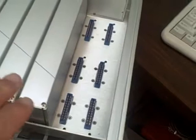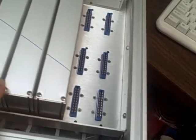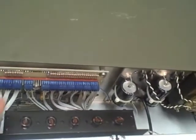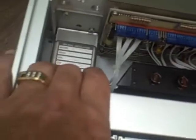I've opened it up so you can see the inside and get an idea of the workmanship. All the units are encased in aluminum for RF shielding. In the back we have an I/O section, a very nice crystal oscillator for the master clock, and the power supply is very clean — capacitors look good, no signs of any degradation.